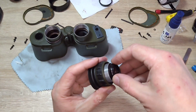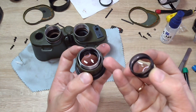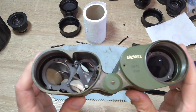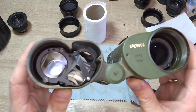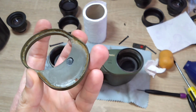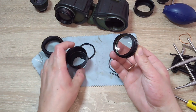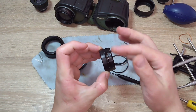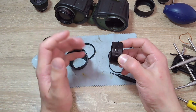The eyepiece is essentially the same as in the Scepter Rimi — it is quite clean. I won't take out the middle lens; it's just not necessary. I have already started assembling the binoculars. I have cleaned the prisms on both the left and right sides. They have a light coating on the prism covers. The sealant is intact — I just moved it a bit. Regarding the objective lens, it's quite simple: unscrew the retaining ring, remove the sleeve, and the adjustment ring can also be taken off. From the inside, unscrew another retaining ring and remove the lens, then reassemble everything.